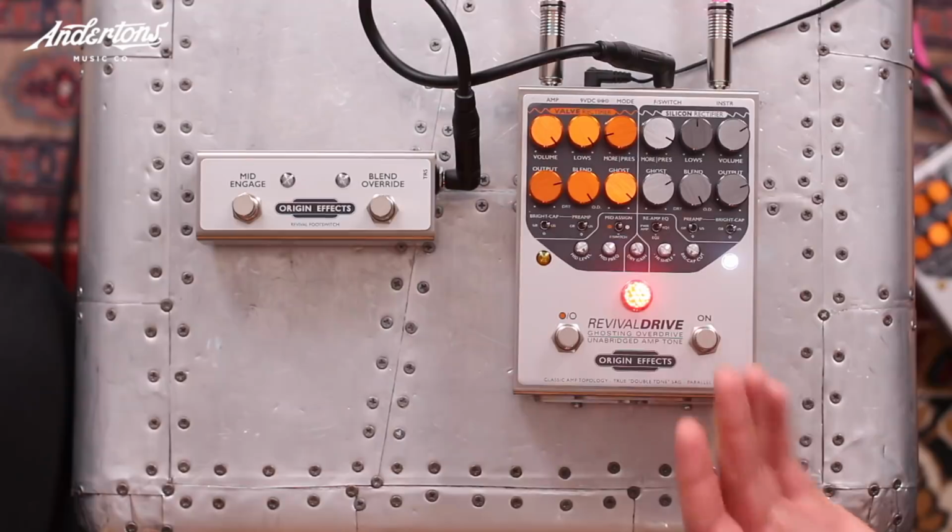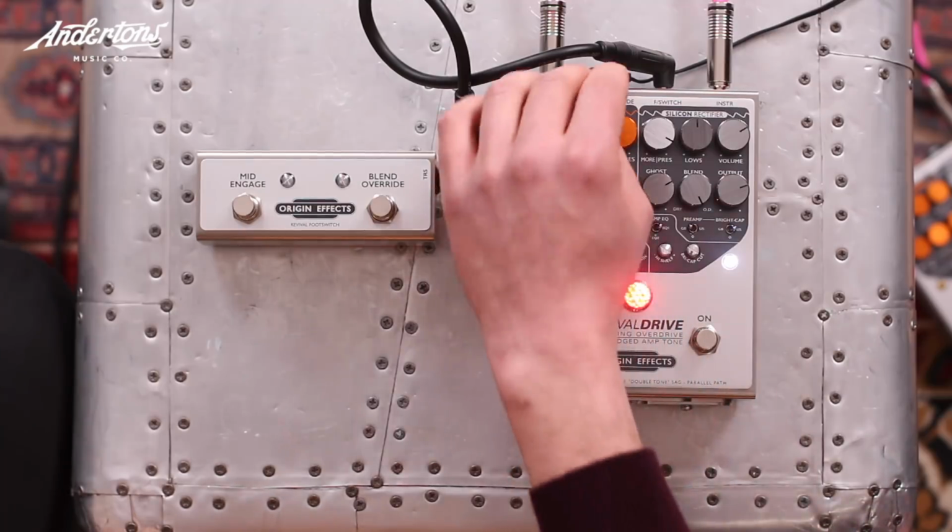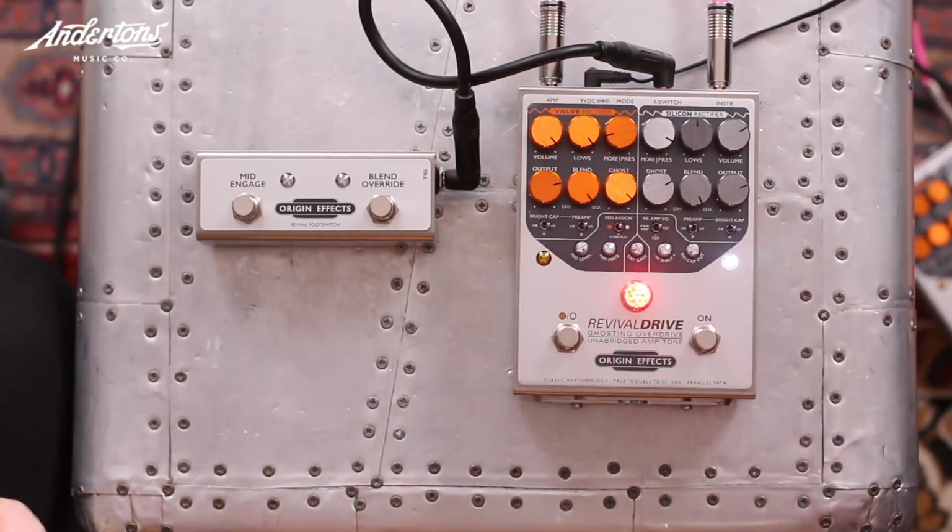So we've cranked the input right up. So the amp, if it was an amp, is fully cranked. We have got a lot of double tone ghosting, so it gives it that kind of tweed sound where you're getting a lot of double tones around this part of the neck. The lows are fully cranked, so all the low frequencies are pushing the output stage into overdrive, and we are running with the output stage wide open, so it's distorting across its full frequency, more gain, the output stage breakup, where before we had presence, which was just boosting the highs. Okay, and that sounds like this.